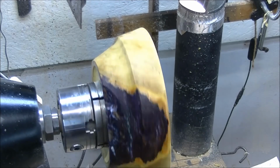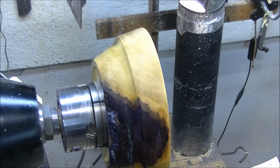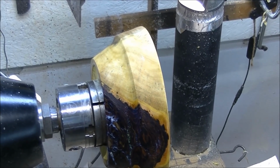I think it's going to be all right. A few more coats of sealer on it, and polish. So anyway, we're gonna let that dry a little while, and I'll be back after a while, and we'll do it again. We'll probably have to sand it a little bit, because this water-based sealer does raise the grain on the first one, and maybe even some on the second, so you have to sand afterwards. But then you're home free. It'll be smooth as a baby's ear after that. All right. See you later, alligator.